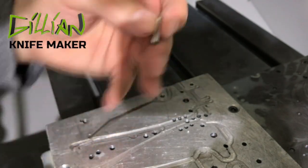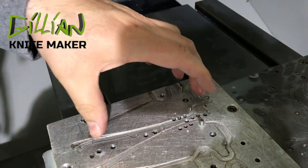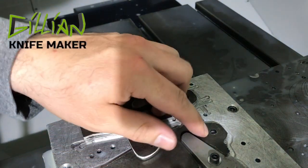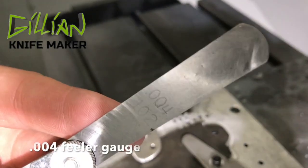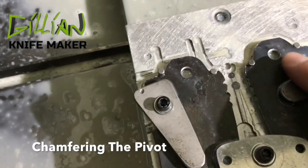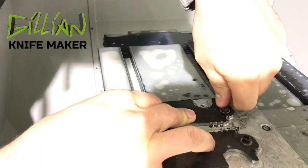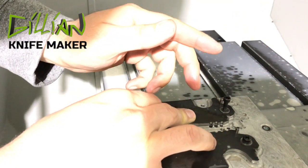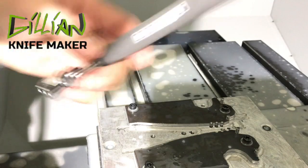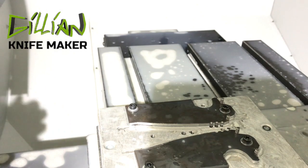These are 5/32" stop pins. I'll use them to locate where the knife goes back into the jig — this ensures the knife is not clocked. We'll do a quick check to confirm the part is flat with a four-thousandths feeler gauge. We're good to go. Now we'll chamfer the pivot. The pivot is now chamfered. We take off the clamps and put the hold-down screws through the pivot hole. The blade is properly located as I tighten down the 10-24 screw through the pivot, with a washer on the end. Checking to make sure it's flat.